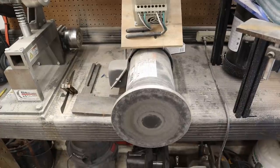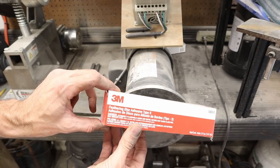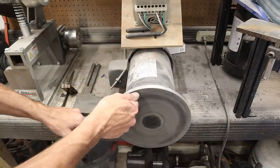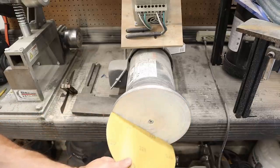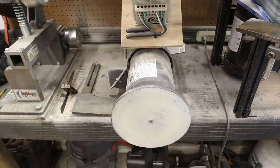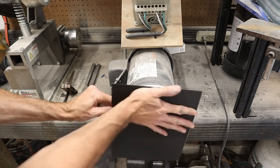So here's what you do. When you get your disc, it's going to be brand new with nothing on it. You buy this 3M Feathering Compound. This stuff is really cool and super easy to use. You cut the tip off, start squeezing, turn your disc on, and you just apply it until it's on. Then peel off your old paper. The Feathering Compound allows you to stick pieces of paper on multiple times — it stays on the disc — so you can take a new sheet of paper and stick it right on.